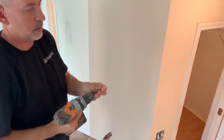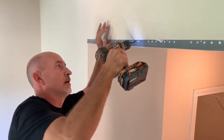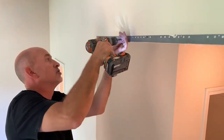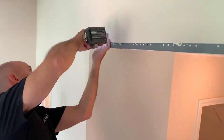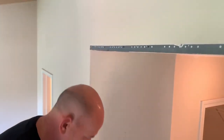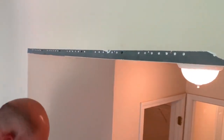What I want to do is take some screws and add them to secure this a little tighter. I prefer to do a screw about every eight inches on the flashing. Tighten that down. Let's do a couple more — you don't want this coming back and happening again.